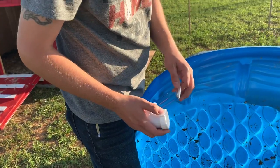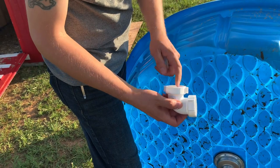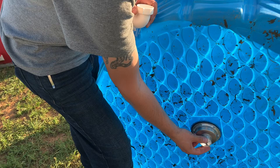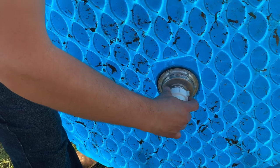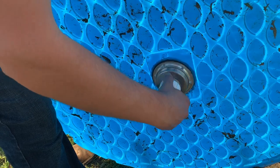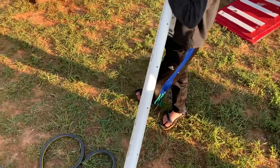We're letting the inside of the silicone dry. Meanwhile, we're gonna attach the elbow. Again, this is a 1.5 for like under the sink, 1.5 to 1.5. And it's got this tail cap, I believe is what it's called. And it's gonna sit in right here, keep it from also leaking. Just thread it on there. Turn it any direction that you want it. Just tighten it down. And then the next piece will be the PVC pipe,